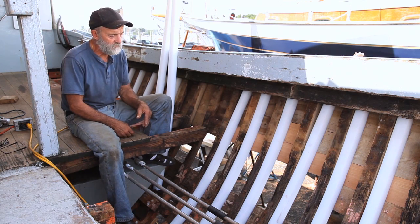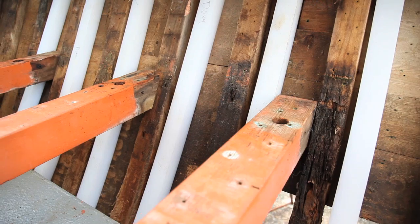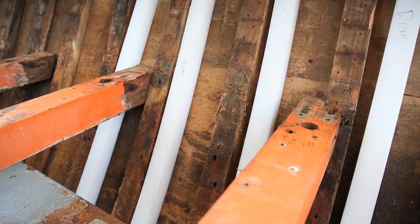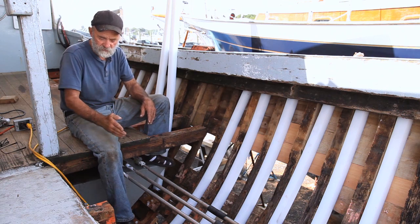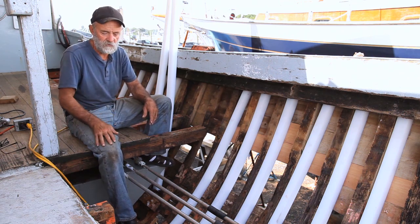That's a brand new construction, so obviously the frames go from the sheer all the way to the keel. These are not — these frames are 8 feet long and it takes about 10 feet to get to the keel. We can't make that connection down there well because we don't have the boat pulled apart in the middle, so we've decided to end them a little short of the keel. All the framing down below is actually in good shape anyway.